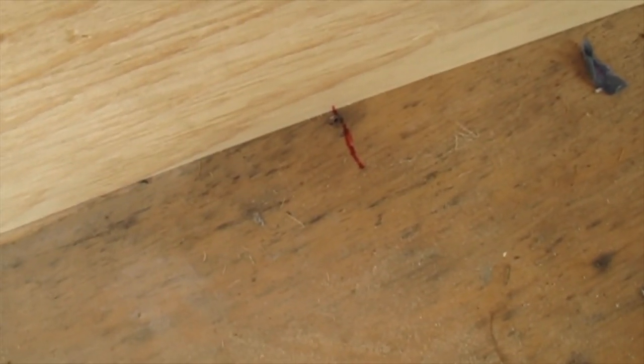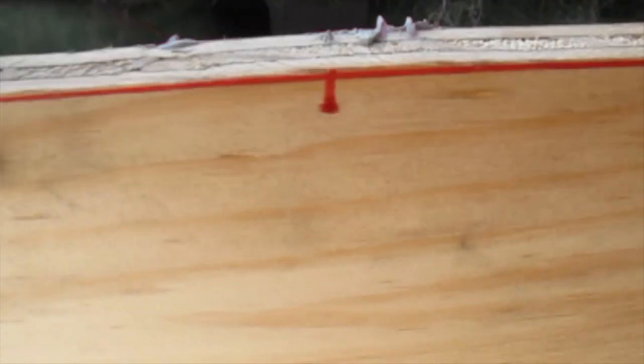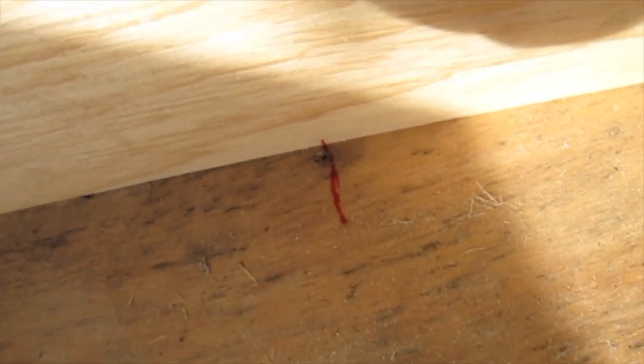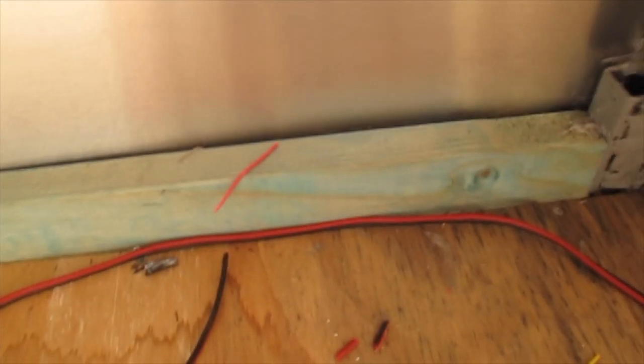Place a little mark on the floor before you put the sheet in — on the bottom and the top — so you know where you're fixing into this steel strut. Always make a mark so you can line them up on the center of the sheet, otherwise you're going in blind. Across the bottom we've got that timber so it's pretty hard to miss, but the steel on the edges is about 20mm in.